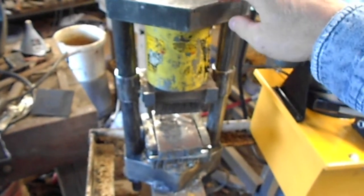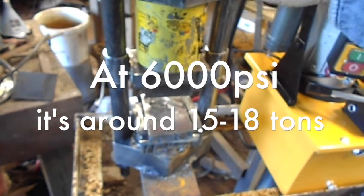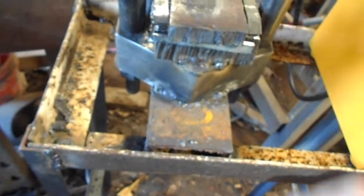We'll start off with the press itself. It's a hydraulic hose crimping tool, and what I've done is come in and covered the collet body up with a big plate, and did the same with the top. I've also put removable dies in, where I need drawing dies like that, I've got that made.